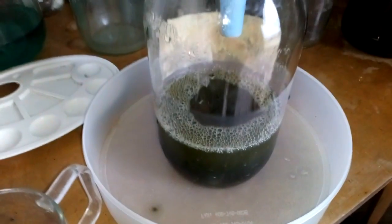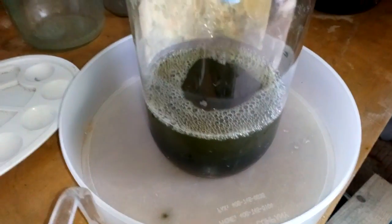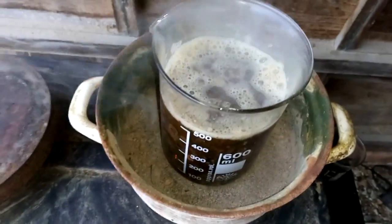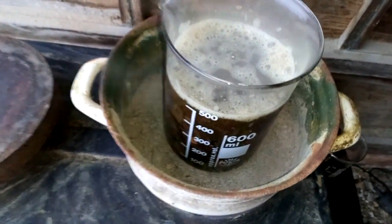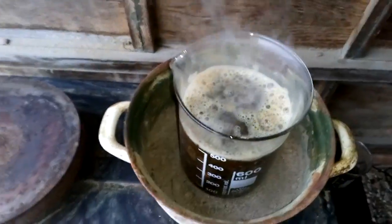We start filtering the first batch. After we finish filtering the solution, we go to the next step — you already know it — denox with urea. I returned the fiber and silicon die residue from the previous two batches. After filtering, I combined everything into one big batch and added some aqua regia just in case we got some gold. I already did a stannous test — there's just a slight positive, not too much. Over 90% of the gold we already extracted the first time. Just in case, we will repeat that process and drop that gold separately from this batch.